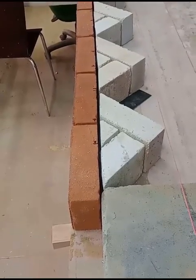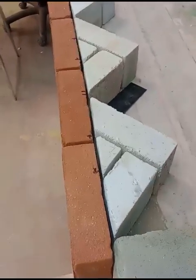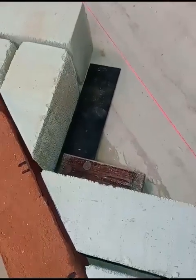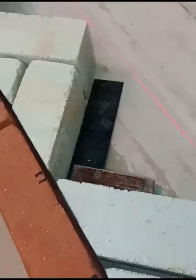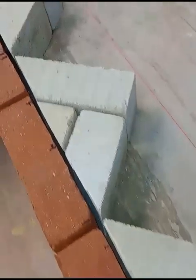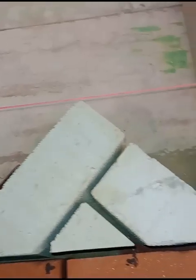As you can see, there are all four starter triangles, all set out quite neatly. Got a square in there. You can also use a scaffolder's base plate — that's what we use most of the time on site when we don't have squares with us. They're all looking pretty neat. I've also put a line through to get all the tops in line, so then we'll go on to the next stage.